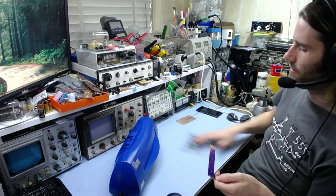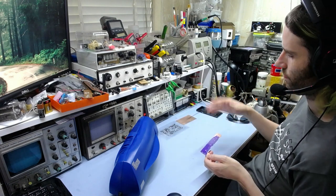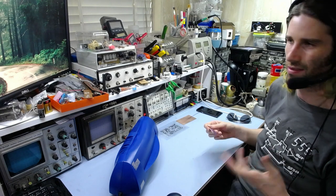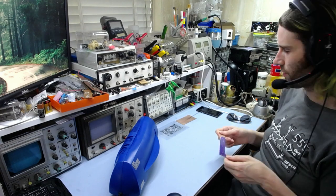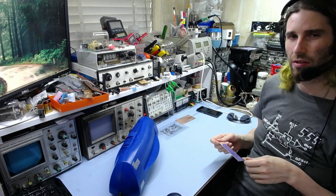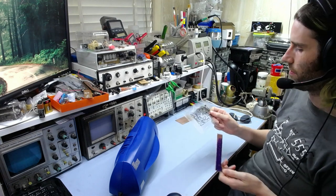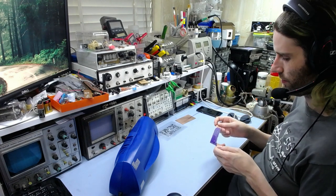That kind of makes sense. I didn't have the OHT sheet in the way, which would have reduced the UV light going through and increased the time needed. Also, this is obviously fresher stuff I just bought — the old stuff had been sitting around for years, so the chemical reaction would have slowed down as it degraded. So I'm going to guess about six or seven minutes was the sweet spot here, meaning I'll do this new board for about 10 to 12 minutes. This stuff's not that critical — you can somewhat overdo it and it won't really matter as long as the mask is good at blocking light. Since it's fresher than the old stuff, it probably doesn't need the full 15 minutes.